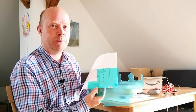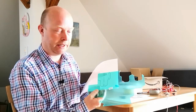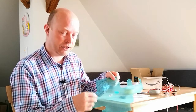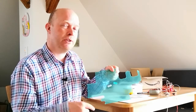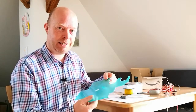Stick with very fine drill bits, maybe 3mm, and then try and drill very, very slowly from both sides, because it splits so easily. When I start drilling this, I'm going to drill it before I cut it out, so there's the least chance of actually splitting the acrylic. But that's one of the tricky ones. A drill with a very slow RPM, even a hand drill, can be very useful for drilling these. A high-speed drill will just rip your acrylic apart in no time. So drilling acrylic is a bit of a dark art in itself.